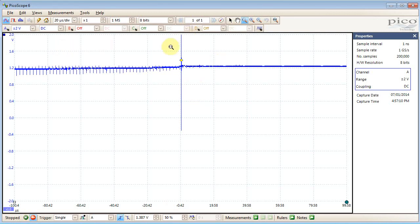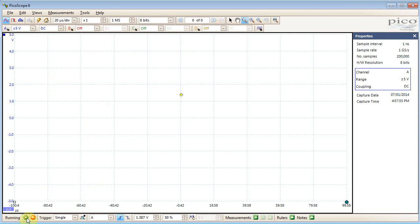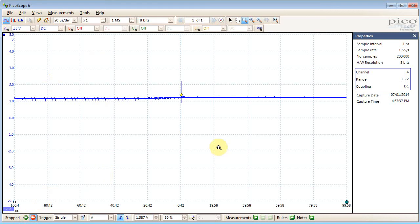Here's where we run into an issue. The spike is going beyond the 2 volt input range, and this is why — even though you might say 8 bits is enough — it's really handy to have the ability to switch into higher resolution. I've had to switch to the plus/minus 5 volt range because there is a spike but I'm also interested in the details. Now we can see the actual limit of the spike, although it's quite short so it may go a little higher than that.